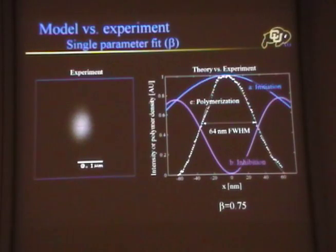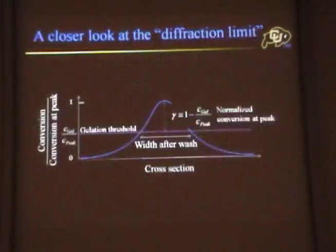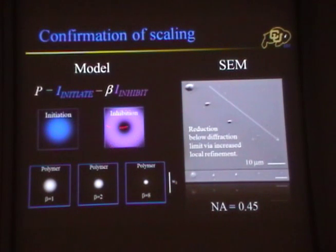Well, to do that, if I have a picture here, my little spot somewhere, let's see. Let's say that when I put both these colors simultaneously on the disk, this is a donut, I left a big chocolate smear of inhibitor, and it didn't go away. I left my material, and it was inhibited all around that sample region. Then I couldn't move over a small sub-diffraction spot and do it again. So as a matter of fact, for this to work, the inhibition effect has to go away in the dark really, really fast, so that I can then move over and do it again and draw another spot right there.